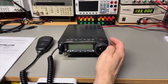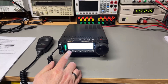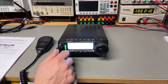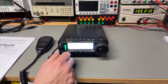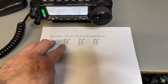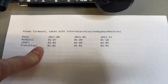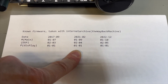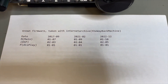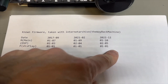This is the non-scary part — no risk here. You go to the menu with a long push on the function button, then go to menu 18, which is factory reset. Having version 1.7, 2.3, and 1.1 means I'm on the very oldest firmware from 2017. That means I can update to the 2021 version and then to the latest. I don't see anything about skipping steps on the JSU website, but the intermediate version is no longer available for download, so I could probably skip it — but I don't want to.